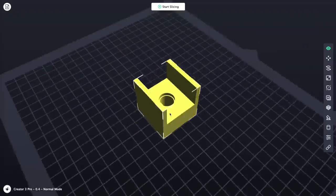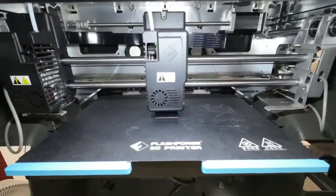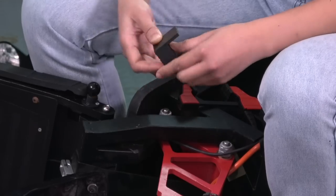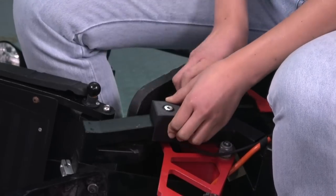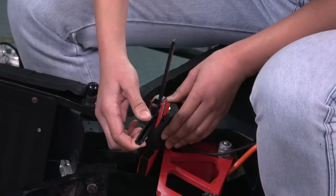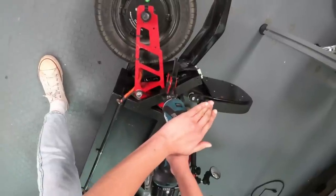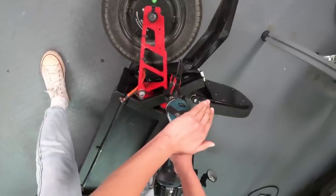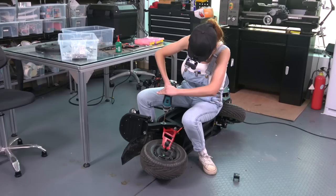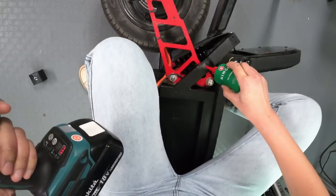Here's a trick I use a lot, 3D printed drill guides. If I need to make a straight hole and it needs to be precise, I 3D print a guide, push a drill bushing in and clamp it in place. That lets me make a pilot hole that I can then enlarge. Make sure the hole in the 3D print is loose enough that you can take the bushing out when you're done and reuse it for other projects. Otherwise, you'll have to keep buying them as you make more jigs.